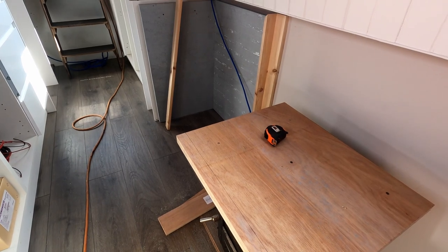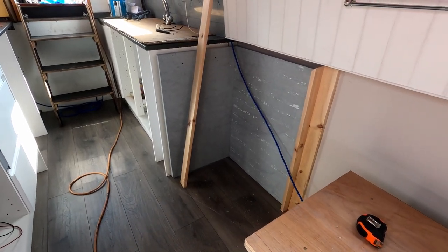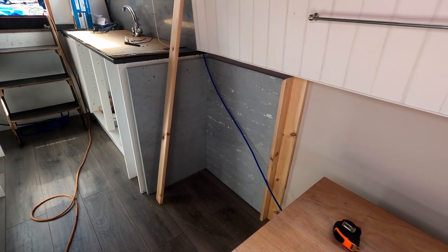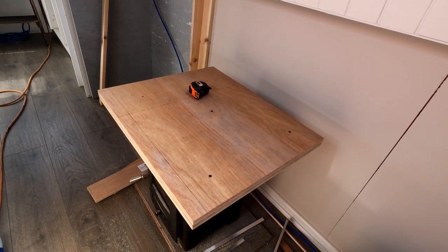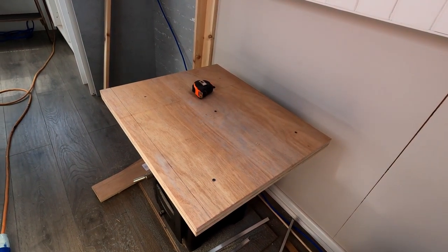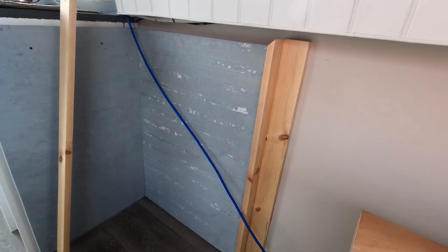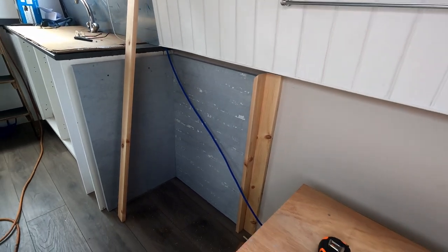It must be the middle of the day already. I've got the end panel in, the silicate boards in, and the metal packing so there's a cavity around the back. I'm just re-cutting this base — it's two sheets of 18mm ply screwed together — which I made too big. I forgot about the depth of the silicate. I've started putting the edging on, which is a mitering job. I bought a new miter block yesterday and I've already managed to saw through it — idiot.